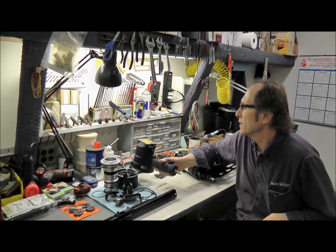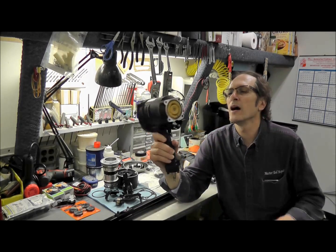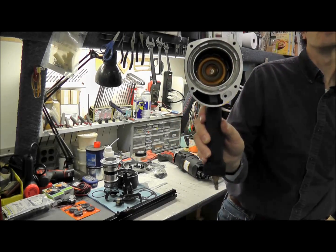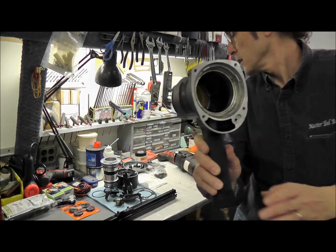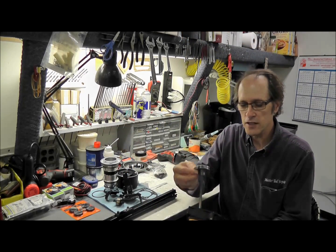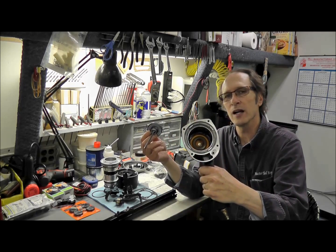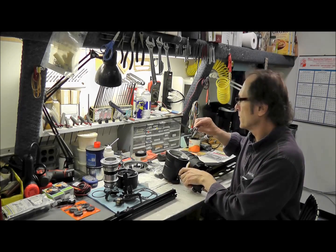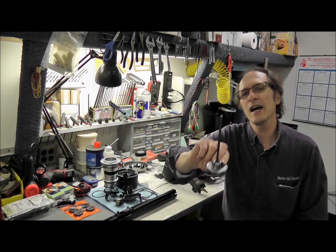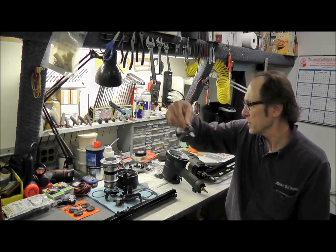We disassembled the gun and this is the body of the nailer here. You'll see that on the very bottom it has a plastic bumper. Inside, this is where the driver actually goes down. This is the driver blade and the piston assembly. It goes down and so it doesn't hit metal — it actually has a rubber bumper on the very bottom to protect it from bottoming out. The driver blade, which actually drives the nail, is basically a half-moon shape to be able to grab the next nail. It's got a standard piston with an O-ring around it.